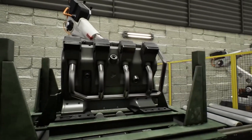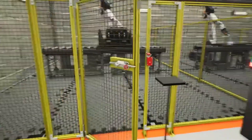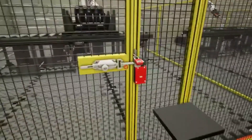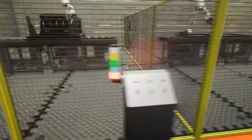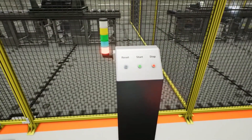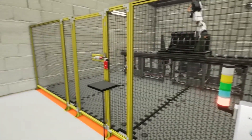As we walk out, we are unable to close this door or insert the actuator into the interlock without removing that hasp. And this is just showing that even if you were to attempt it, the safety circuits are not closed, so you cannot start that machine.